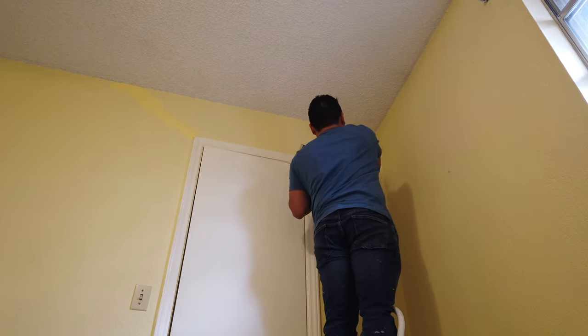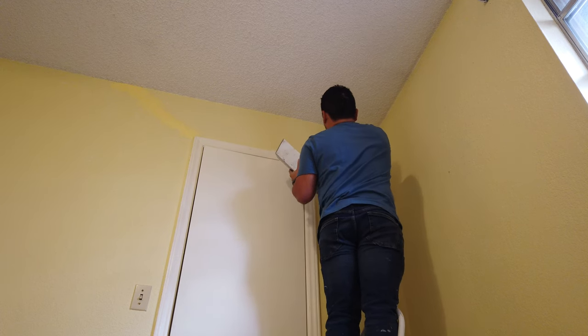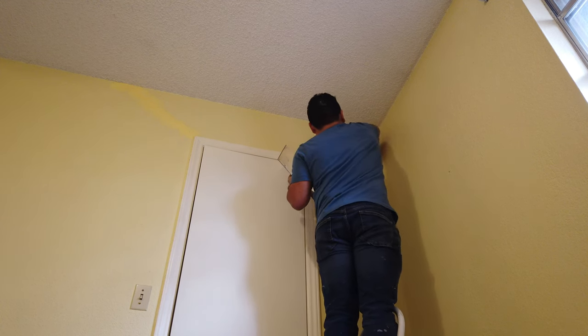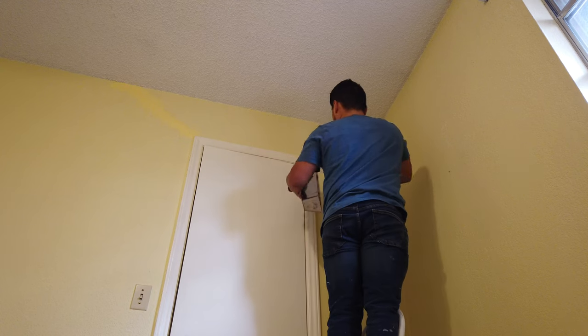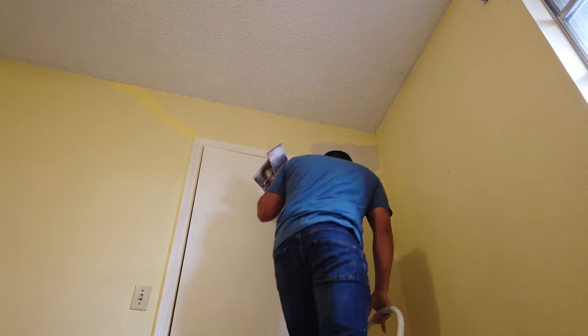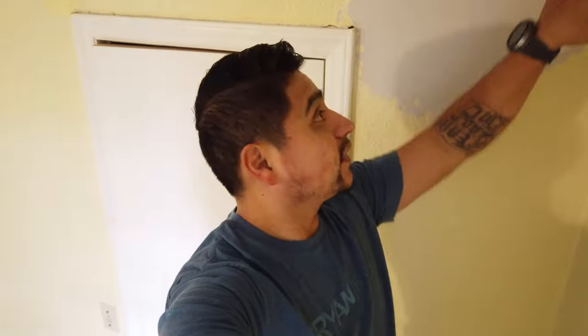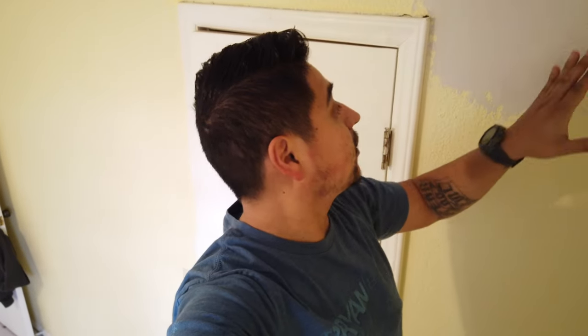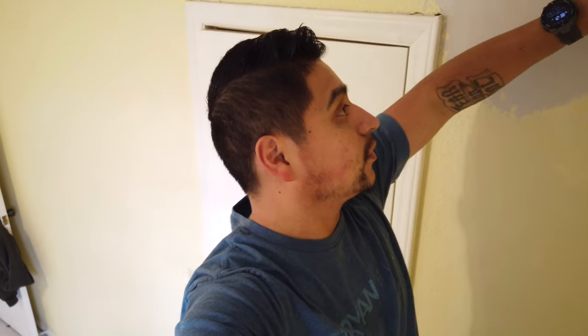Sorry for the bad angle - I didn't have anywhere to put the camera where you could actually see me. Just use the spatula to spread out your joint compound. I have a few other videos on this if you want to check them out, but just spread it out as smoothly as possible. We're doing about 8 inches wide. The crack was about 2 inches and we did about 6 to 8 inches. The reason is we feather it out so we can come back and sand it and level it out so it's not very noticeable. If you try to do a thick coat on top of that repair and only make it 2 inches, you're going to see it. So we feather it out.